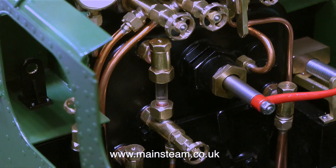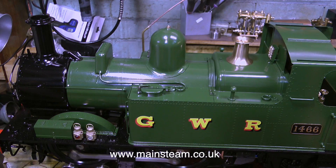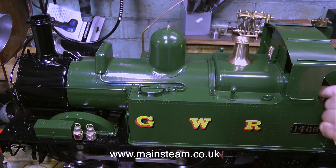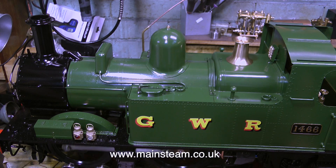This was the level of water showing in the gauge glass before I used the injector. The reason that the injector just knocked off with a big cloud of steam is because the water went right to the top, and if you get water coming down the steam line to the injector, the injector will not work at all. As you can see by the performance of the engine currently, on very low pressure producing fairly wet steam, there's not a lot coming out of the chimney.